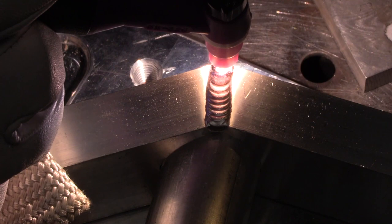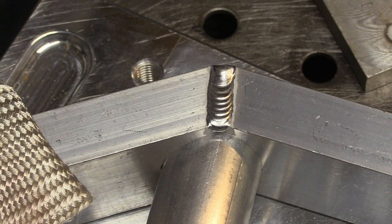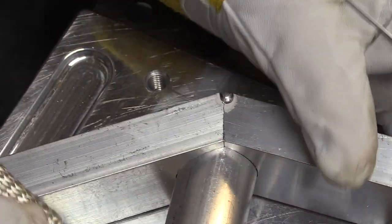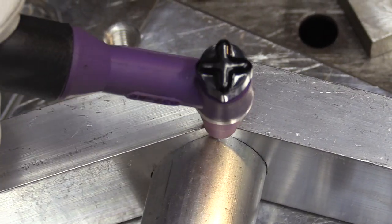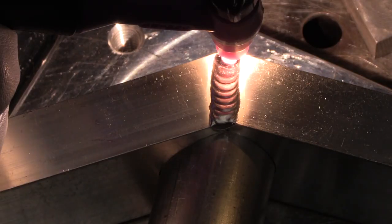I light up here and let that cleaning action work just a little bit to get a clean start. When I get to that end tack you can see it's pretty much consuming it — I add a little bit more filler metal and then move the torch around as I taper off. Otherwise you can get a crater hole or crater crack. Those little crater holes seem harmless but that's where a crack will start, so you don't want them. That cleaning action is cooking that aluminum oxide film away, then the puddle goes in nice and clean, and I add a little extra filler as I taper off and swirl to avoid the crater crack.